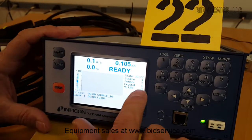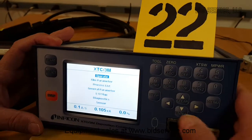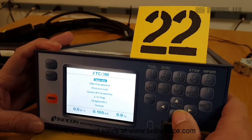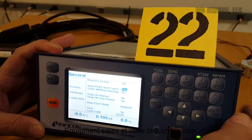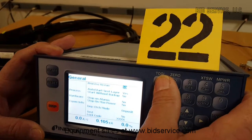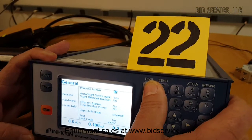I'm going to go to the menu — these are the different parameters for programming it. I'm going down to General Parameters, hit Menu, and it's asking me which process I want to run. I'm going to change that from Process 10 to Process 11, which I've pre-programmed to activate the other crystal — the other sensor.